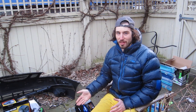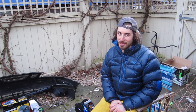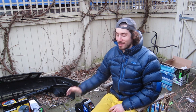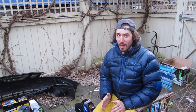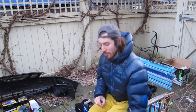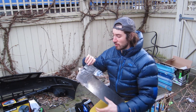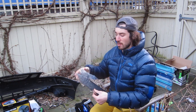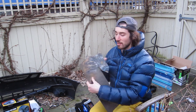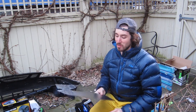So that's basically it for this motorcycle room video. I just wanted to do a little bit of welding, show you guys this new welder that I bought from Harbor Freight. I'm not sponsored by Harbor Freight, but I do buy almost all my tools from there because it's so cheap. This is the titanium Easy Flux 125 or something like that. And I think it works really well. I was even able to dial it down to the point where I can weld a really crappy, but functional, it's not breaking, weld on 22 gauge steel. So this is a very thin steel, and I did have some blow through spots, but it worked pretty well.